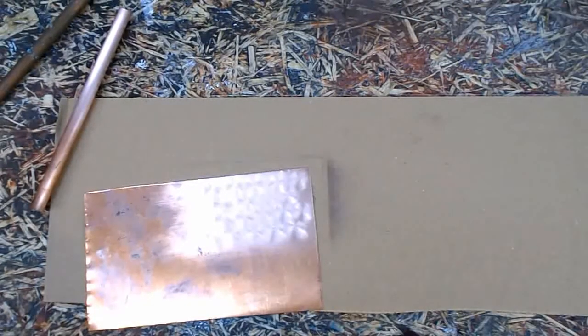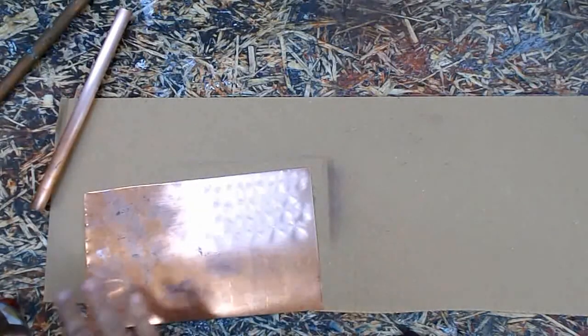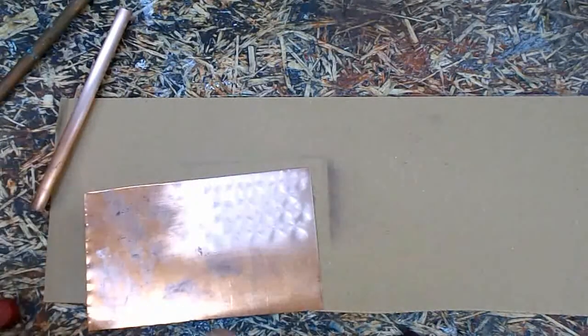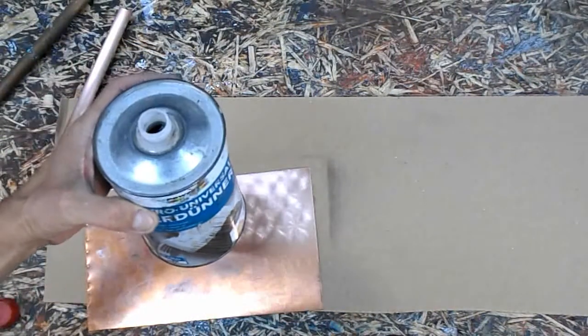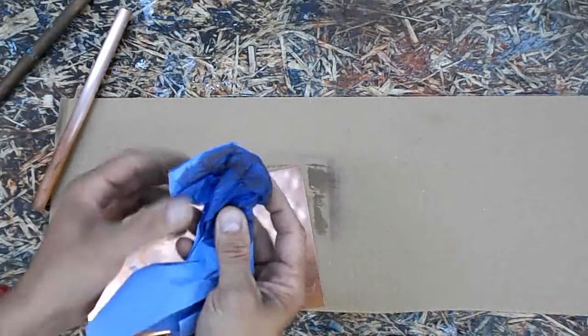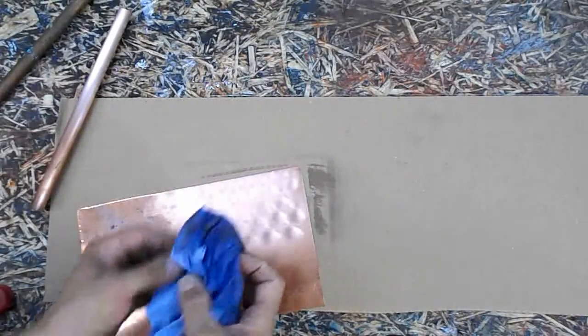And now comes the most important part of the story. I need to degrease it and clean it absolutely perfectly, so there are no fingerprints and residues of oil, grease or whatever left on the surface. I'm doing this with paint thinner or acetone or something similar. Maybe alcohol would work. And here is all the copper from the polishing and sanding.